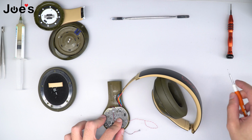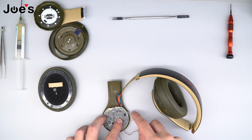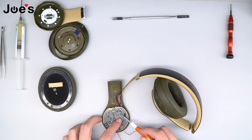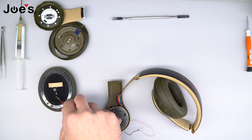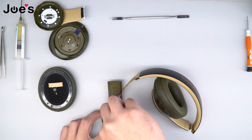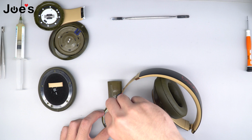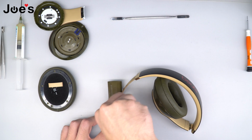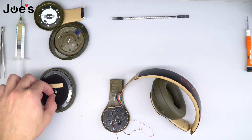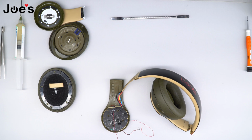When you place the Bluetooth board on there and you're ready to put the 4 screws back in, check and make sure that no wires are showing in the holes so that you don't put any screws through the wire. It doesn't really matter what order you put the screws in, but me personally, I like to stagger it a little.